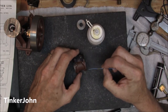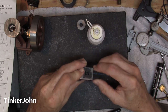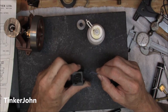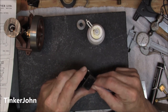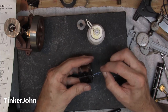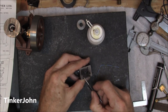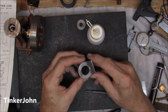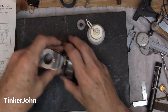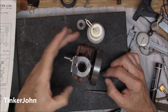For me, the hardest part of the engine has been completed. Different people have different trepidations about the different parts of the engine to build, but to me, drilling the cylinder passages are the most difficult. One reason is I just don't have a whole lot of equipment for that precision type of work. This one goes all the way across with nothing in the middle, this one came up through that end just fine and did not go into the other wall. The walls are intact, so now I've got a really nice cylinder — that turned out very nice. It'll go up here on top of the engine. It's about time for me to start bolting some of this stuff together.